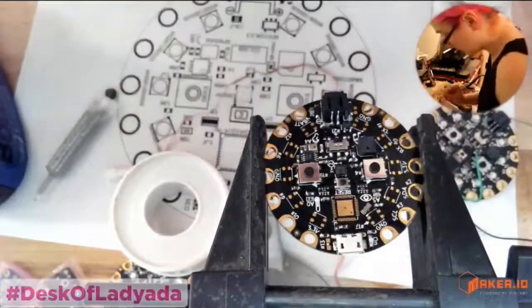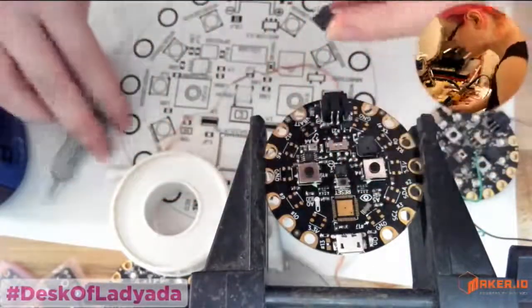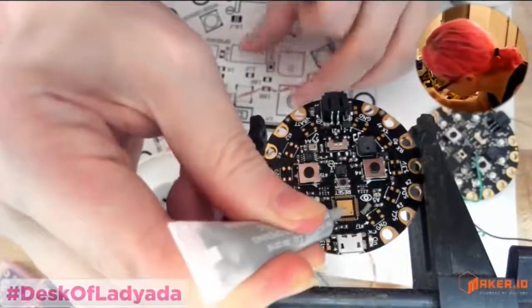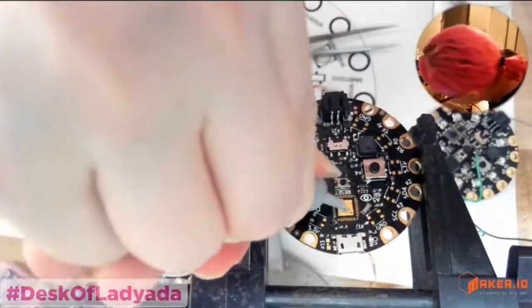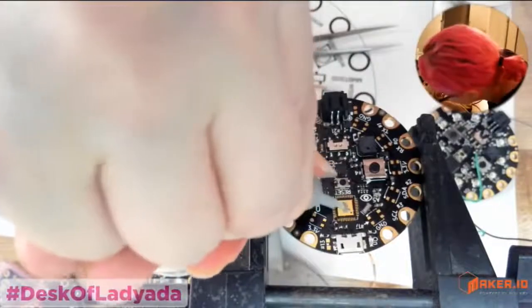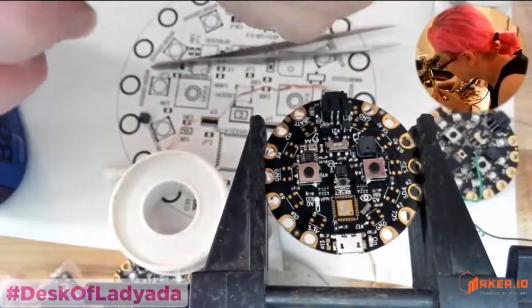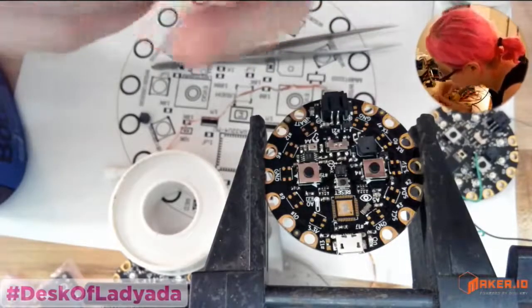And I'm going to solder this component, this microcontroller, onto here, and that's the last big part. So I put a little bit of paste on the center. You really don't need that much. It's used for centering. It's a little bit mechanical, it's not really electrical. Some chips definitely need an electrical contact with the ground pad. Just check the data sheet, but most don't.